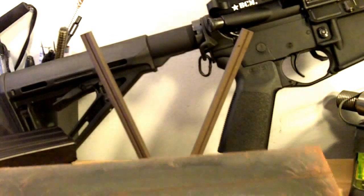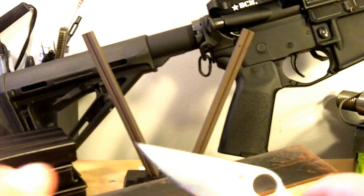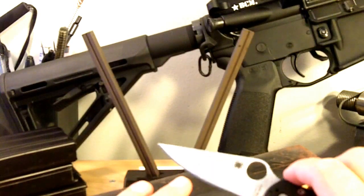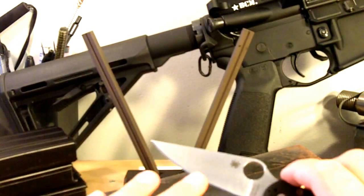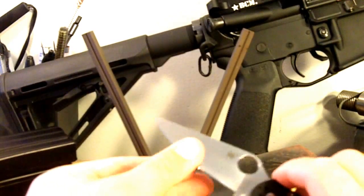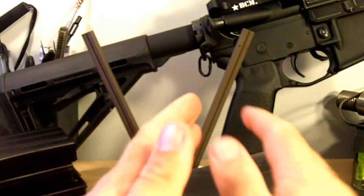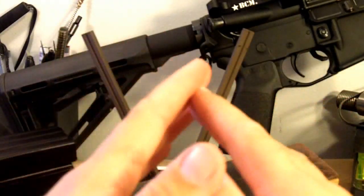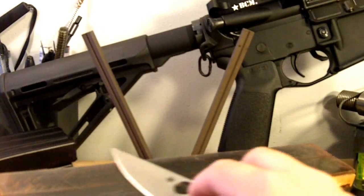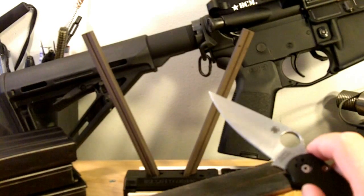One extra note, this is not the Sharpmaker system, but a strop is a really nice additional feature for when you're sharpening your knives, and it does a couple things. For one, it'll deburr your knife. Burring happens in the sharpening process. Basically, you get a little extra really fine part of the edge that's overhanging that you don't necessarily want, because it'll be really easy to bend it over or chip or break off. So you really want to deburr your knives after you sharpen them, and a strop is really nice for that. And also, the strop is really nice to maintain the edge.